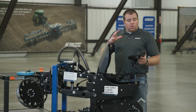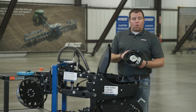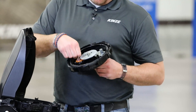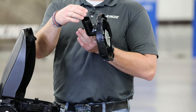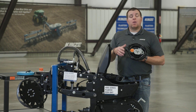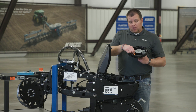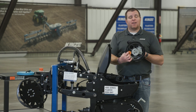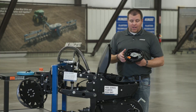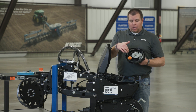Okay, so we've got our ejector out. The unique part inside the meter cover — and this is only for push row units — is we have to utilize something to block off the vacuum for those front rows when they are not being utilized. Inside that meter cover, if you were planting corn, this plug would be located in the vacuum elbow so your hose is always on the meter. We use this plug inside to block off the vacuum so no vacuum leaks when you're just using the rear rows. When we're going to utilize the front rows to plant soybeans, milo, or one of those other crops, you need to remove that cap and put it into the storage holder right inside the meter cover — it just lives inside the meter cover. On a 4000 series (4905 and 4705 model planters) you won't have the cap, but the storage location will still be there. So for push row units, take the plug out and put it into the storage location.